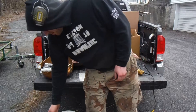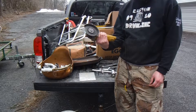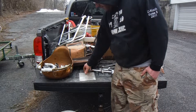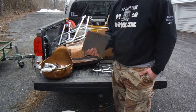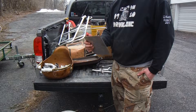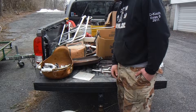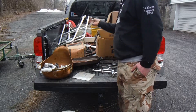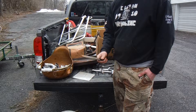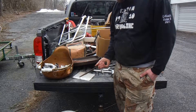Put the magnet down and get yourself a grinder. Some people use a file — I like the grinder, it works easier. This is a piece of stainless. When you hit stainless, it's going to spark sort of red, but there's not going to be a whole lot of sparking. If you hit steel, it's going to throw a whole lot of red sparks. That's how you tell the difference when you hit them with a grinder.